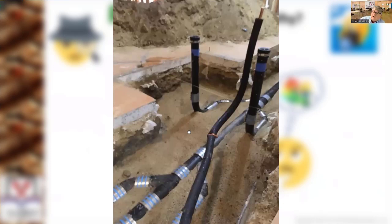Congratulations, that is the major flaw. There isn't an inspector in the world — well, there might be some — but if you're following the Cast Iron Soil Pipe Institute handbook and you can prove that you're on virgin soil with solid bearing that's been compacted throughout its entire length, then you're fine without hangers. But in most cases, plumbers over-dig trenches, or they're not paying attention to the excavator, and the excavation contractor over-digs it, and nobody ever gets in a trench with a compactor and does it in compliance with the code.